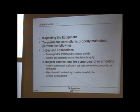Either the circuitry in it is wrong, the settings on the breaker are wrong, the wiring size is wrong, or the motor itself, the armature, something within the motor is wrong to cause it to keep tripping. Because if everything is good, okay, the wire is correct, the size of the breaker is correct, the setting on the breaker is correct, yet the motor has nameplate data on there, and it's got a rating. If you put an ammeter on it and it's drawing more amps than it's designed to, something is wrong with the motor at that point, and not any of the other equipment.